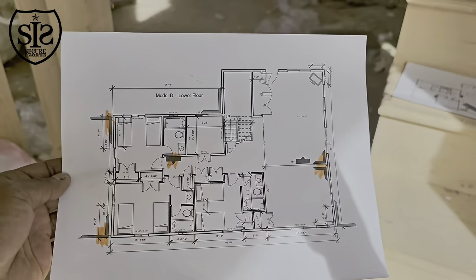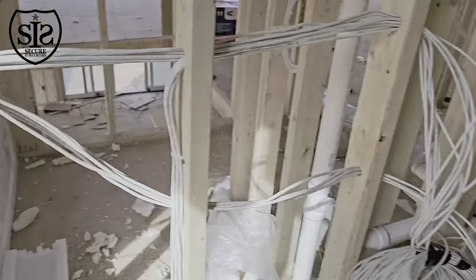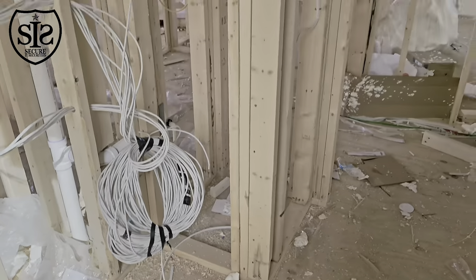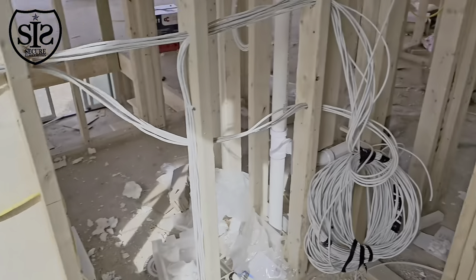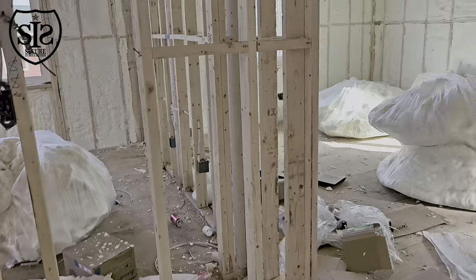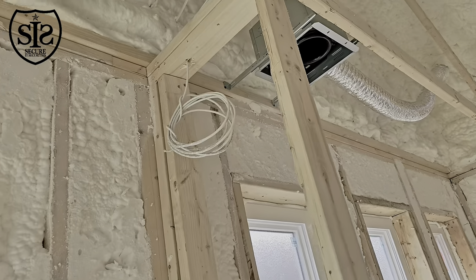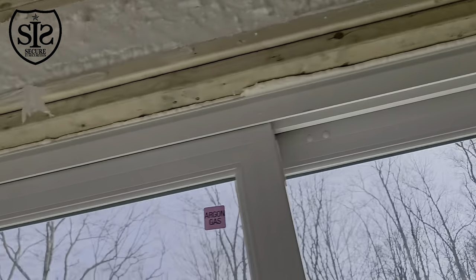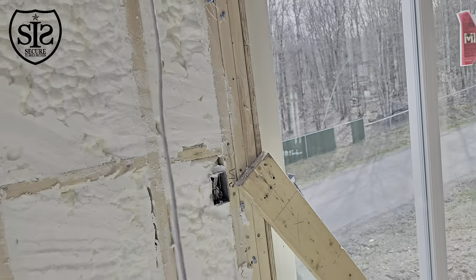Here's a copy of the lower floor and here's the layout for the upper floor. This is the head-end — this is where all our wires would go to, which would be the office according to the layout. On the upper floor, we ran a wire for a camera right here, and then we ran a wire for an indoor intercom station that's going to go right here.